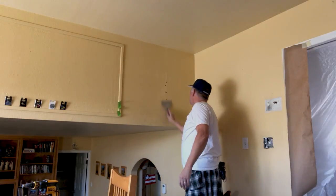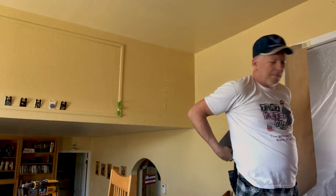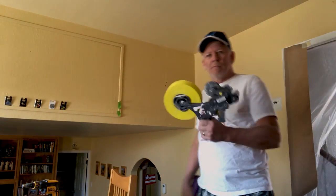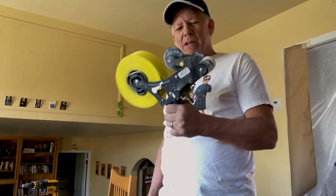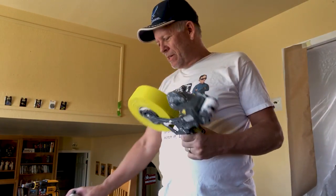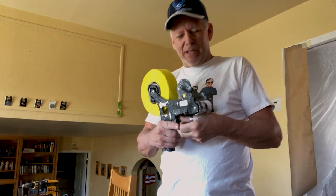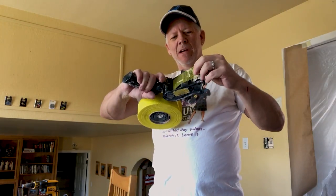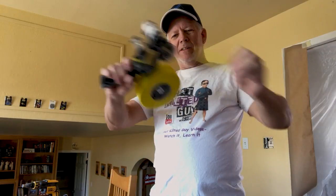Now I re-scrape it because putting in the screws often loosens up little chunks of mud, so give it a quick re-scrape right down the seam. Now I use this handy little mesh tape gun here. These are really handy — if you want one of these, I'll put the link in the description down below. Basically it's a real simple design; you pull it off here and it cuts with that razor right there, so wherever you want to cut it, you cut.